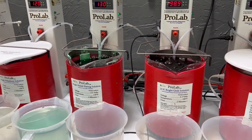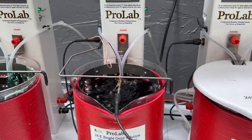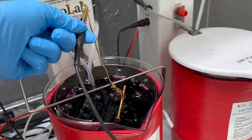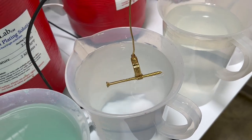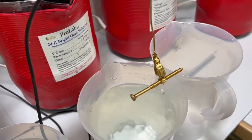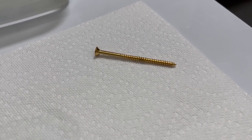Right now it's very popular in the home industry — bathroom fixtures, door fixtures — with the gold plating. We'll leave it in our gold tank for about two minutes. Our two minute mark is up, so I am going to go ahead and take the part out of our gold solution. We'll put it through our first rinse and right there you can see how bright and shiny that is. Go into our second rinse. Beautiful! Check us out for more YouTube videos at Gold Plating Services — look for the Golden Globe.